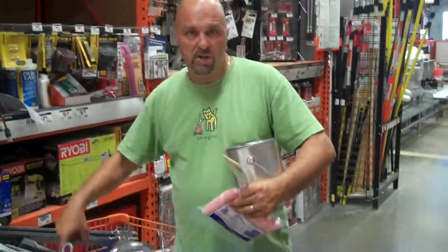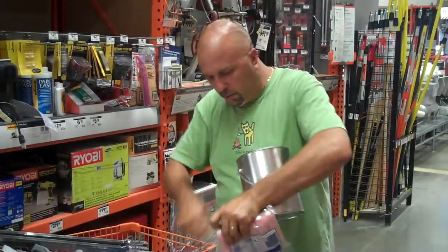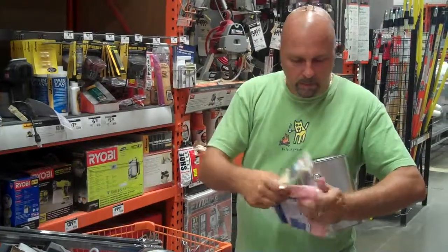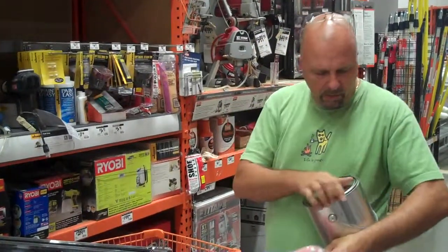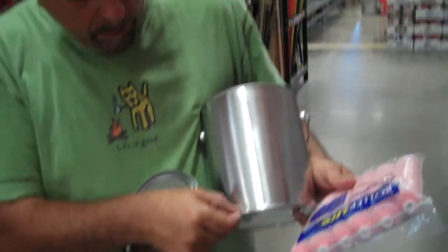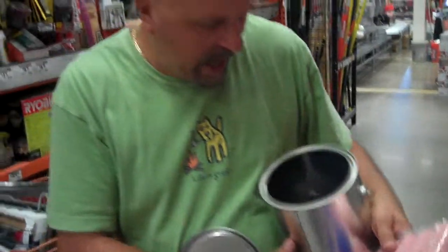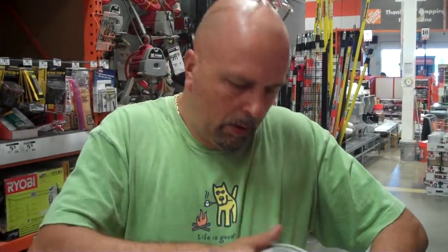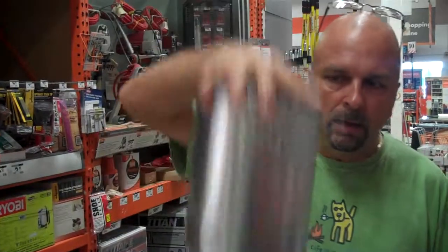You've got to be careful — a lot of guys leave these buckets dirty. At the end of a job, they're supposed to take a paintbrush and wipe out all the excess paint back into a can, and squeeze out all the excess paint off the rollers. Once you pull the roller off, you take four or six of them and throw them in here with the paintbrushes, and you only put about a quarter inch to half inch of thinner in the bottom of this can — don't fill it. Once filled with that day's paintbrushes and rollers, close it, seal it, shake it upside down, and leave it with all the sausage rollers touching the bottom so they constantly soak up the paint and stay wet overnight. You don't throw paintbrushes away at the end of a job — you throw them into this and they have life.